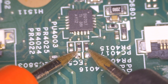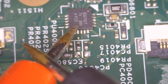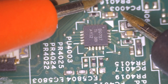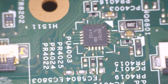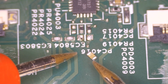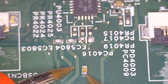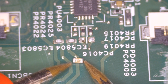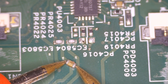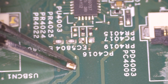I'll come back and see if I have a beep anymore. The beep didn't go away — it is still there — and that means this board is still shorted from somewhere. Checking the capacitor I removed: it is not shorted, it is not beeping. I mistakenly identified this one as a shorted capacitor. I'll put it back and go find the issue somewhere else.